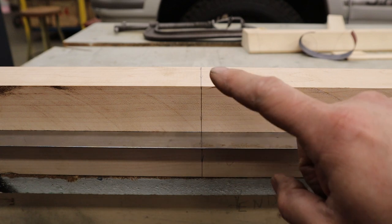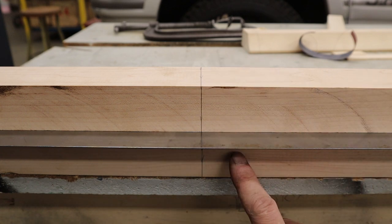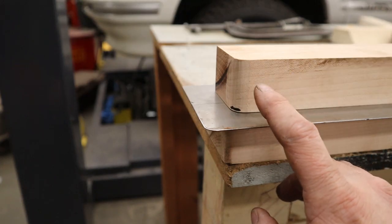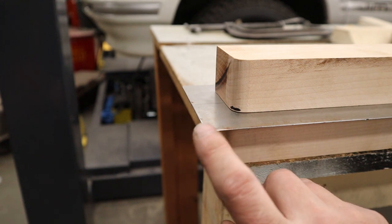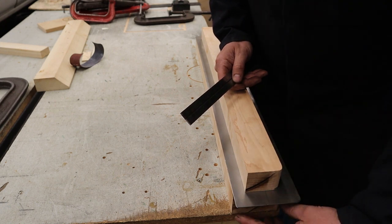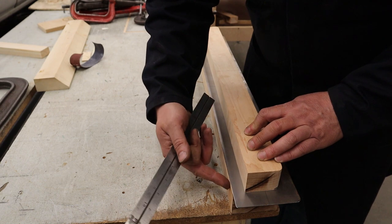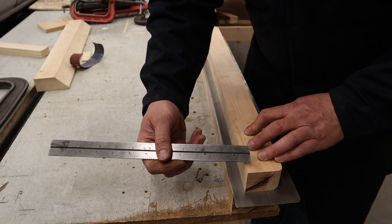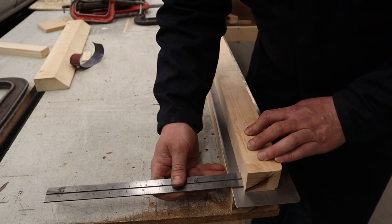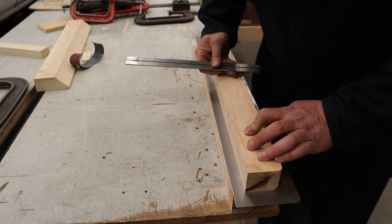Now when you go to set this up, you can see those center lines are helping line up the clamp to the center of the metal, to the center of the form. And that's placing both the left and right clamp in the exact same position over top of this so that this will get the same amount of bend. And then this form is not supposed to be in the center of where this form is, but we do want the sheet metal right to the edge of the front of the form, so that's where that is. And then this is supposed to be 3/4 of an inch in is where that angle starts. So just take a ruler, make sure that both left and right sides are set at 3/4 of an inch, and then you're ready to clamp.